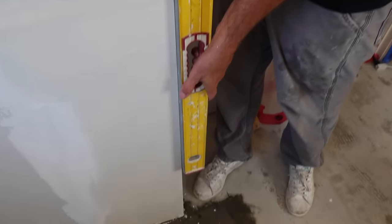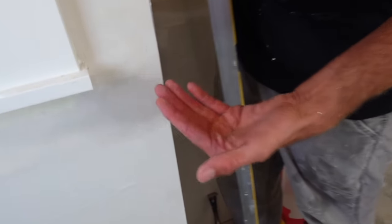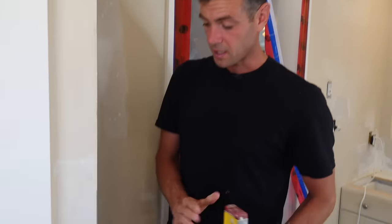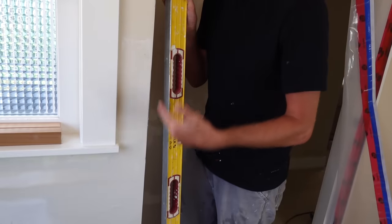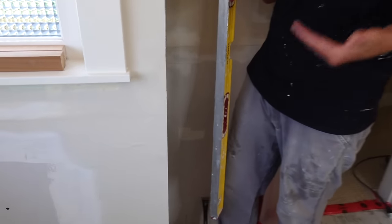So that's about it. Right now there's two coats — we're going to do one more coat of all-purpose mud at least. But you can see it looks nice and straight and we've got that tape under there, well hidden, that's going to stop it from cracking down the road. Those are your two major concerns: that little one-inch crack or having it go dog-legged. This is especially common when you're doing a two-foot cutout, like when you have water damage in a house or a basement. You could also do it with steel corner bead — the main thing is when you're nailing it on, make sure you use a level to make sure it's straight. I just like doing it this way because I'm more efficient installing tape on corner beads.